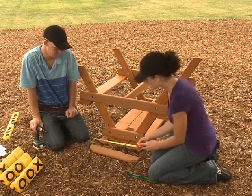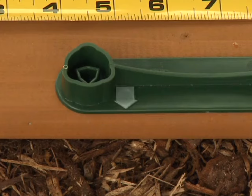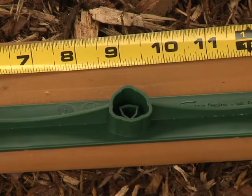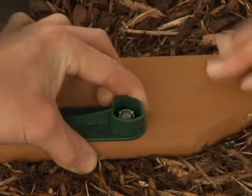Place the other tube mount on the 0/17 TTT bottom. The center should be 9 inches from one side, and make sure the arrows are facing out and it is flush to the front edge of the TTT bottom. Then, attach it with 3 S10 pan screws. Do not over-tighten the screws.